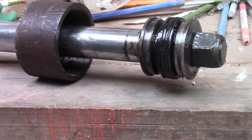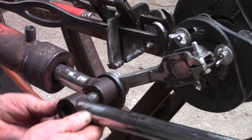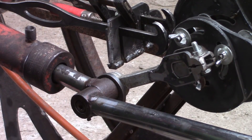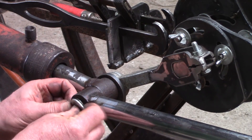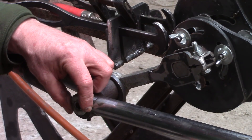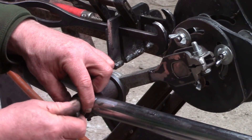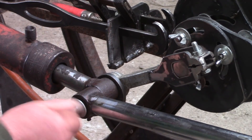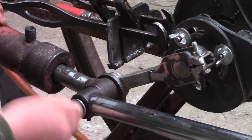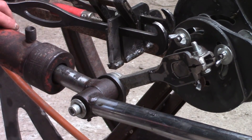So I might not gain a lot despite all the work involved. Of course, if I had fatter pistons and cylinders, making them double-acting would make more sense — and lots of you said that's what I need — but I don't have any and new cylinders are very expensive. So I'm sticking with single-acting pistons; the momentum in the flywheel should push them back in again.